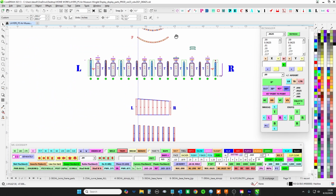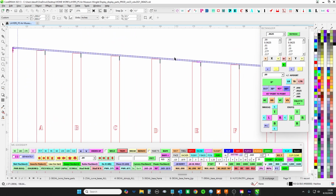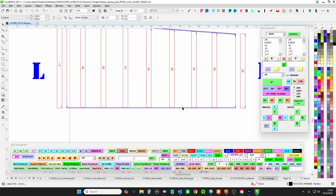And then you're just going to Lords it, big old Lords party. And you're just going to Lords on all of the verticals and then do the best you can. That's why I chose 1/4 inch. That's all you're really going to get. So make sure you put a fat bead on both sides of these, and utilize that 1/4 inch and really squish it down.